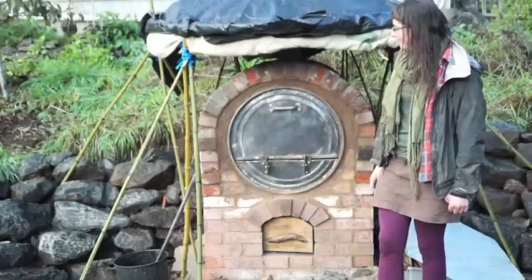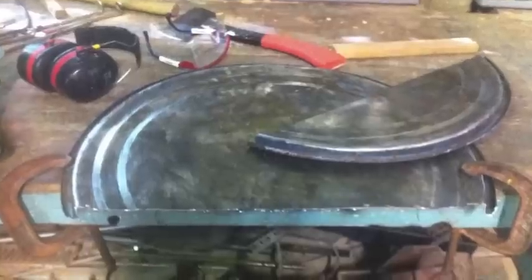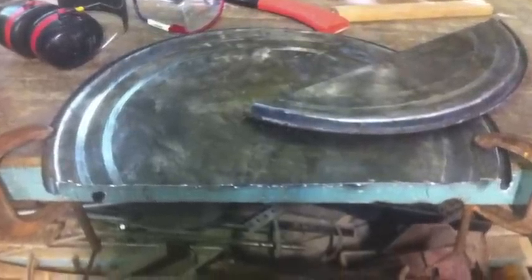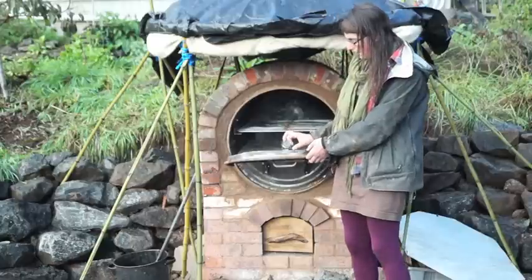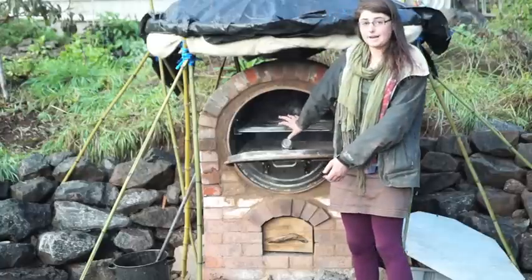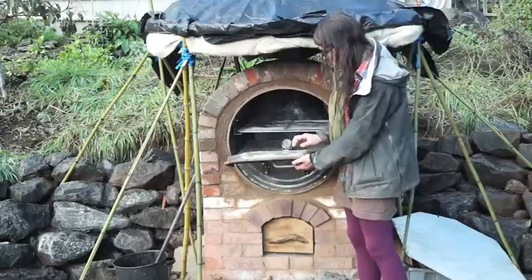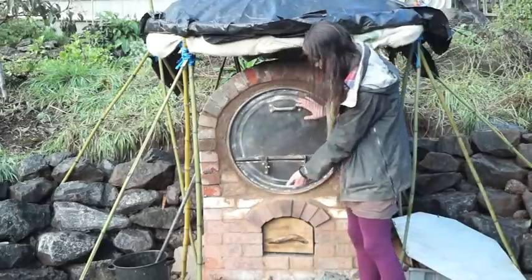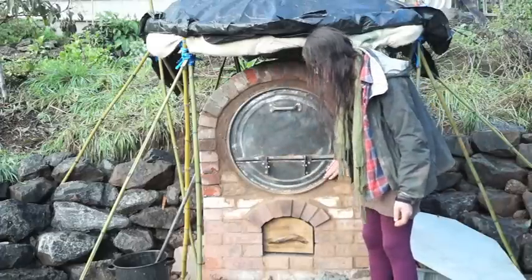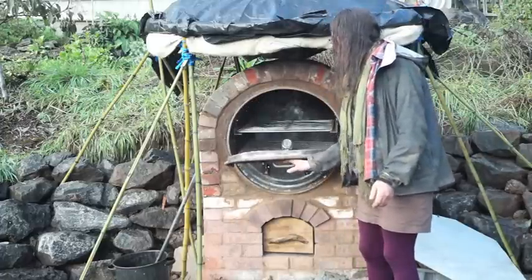I am a new metalworker, and I was really excited about learning the techniques of creating this barrel, including all of the welding and fabrication of the metal parts. This is a 55-gallon drum. It has a lid that was attached to it, and I added an entire box of insulation to really keep the heat inside the oven. I welded that insulation into a little box inside the door, which I split into two. I then welded the bottom of the door onto the barrel itself, and fabricated these hinges so that when you open the oven, the door is self-supporting.